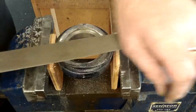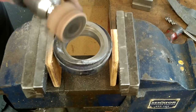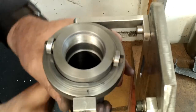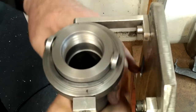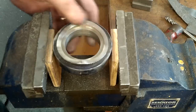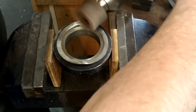By now the rail was ready for tuning, and this was done by fitting a couple of bearings to the advance tube and sitting the tube in place. Rotating the tube, the unequal high spots on the rail would cause one bearing to rotate and the other to remain stationary. Then one simply polishes off a little material from under the rotating wheel and tries again until both bearings rotate at an equal pace.